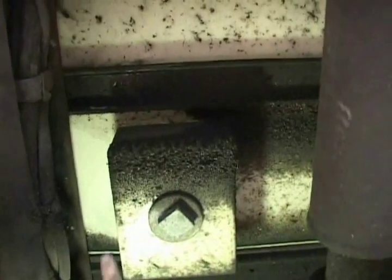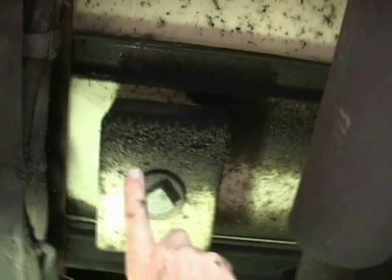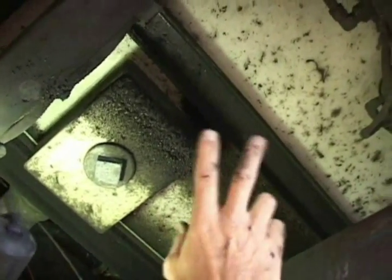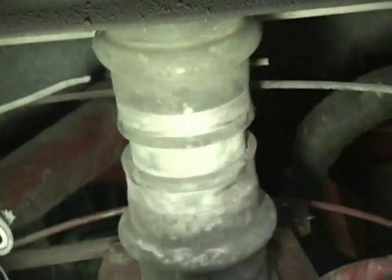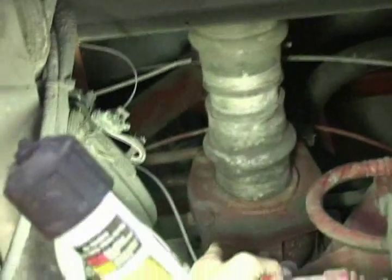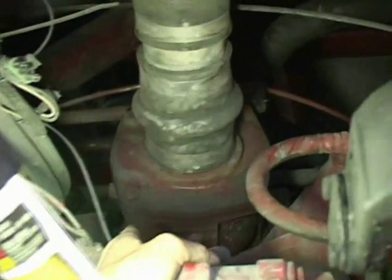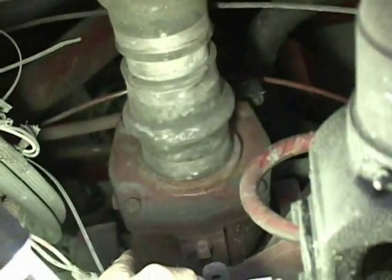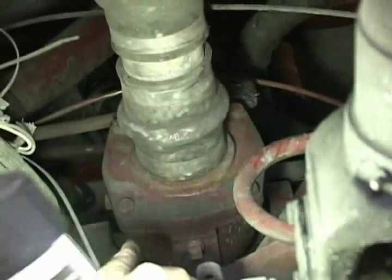While you're in this area, it's convenient to take a look at your water tank. This is the low point drain of the water tank. You can see the large plug right there at the low point in the plastic poly tank. This is what we use in a standard Miami pumper, and most fire trucks now have poly tanks made of plastic. If you look straight above my finger here, you'll see the tank to pump valve. This is a large diameter two and a half inch valve that will flow 500 gallons per minute, so you should be able to dump your tank within one minute if you're flowing a large volume of water.